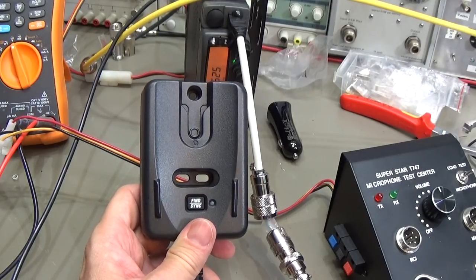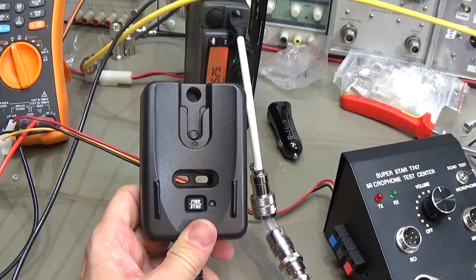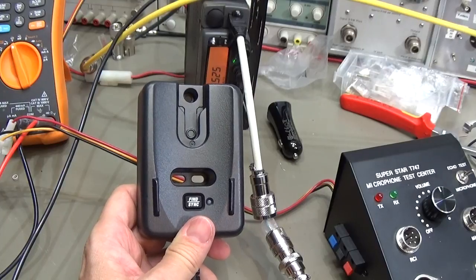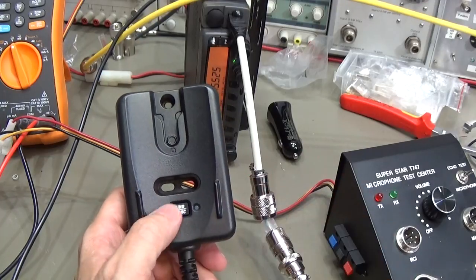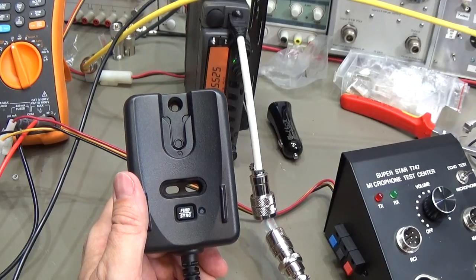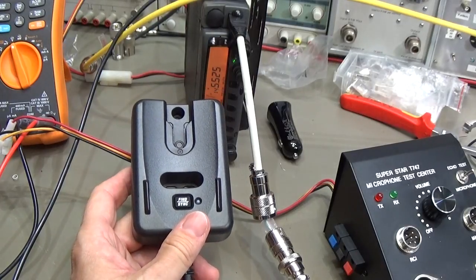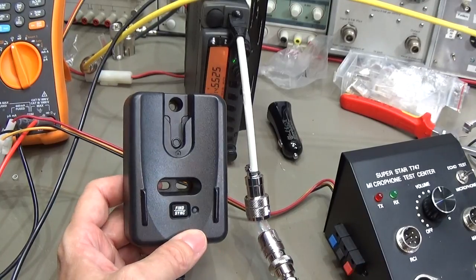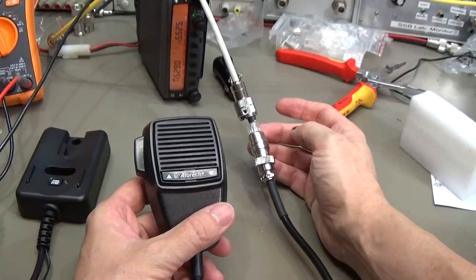We really do not get what we need. Okay, so we really need to supply our cradle from a 13.8 volt source. Otherwise, we obviously have problems here. It is not willing to work with this low voltage. Let me do a very last test to see if we really have done everything right.